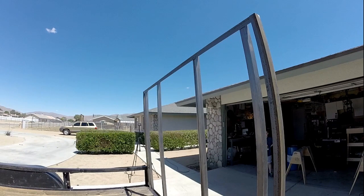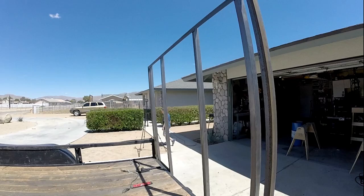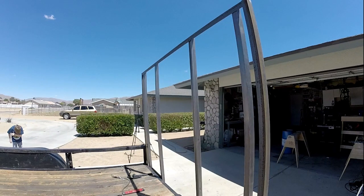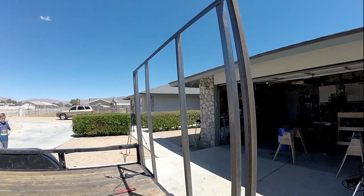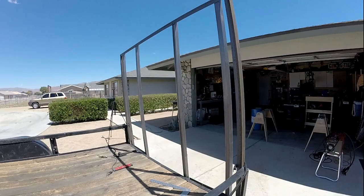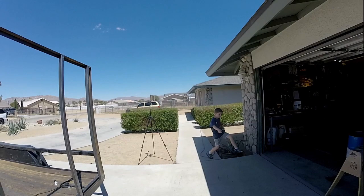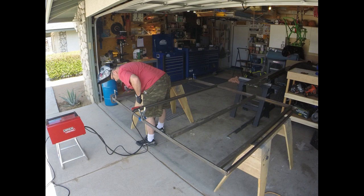In making this I realized that those sheets of metal are four by eight, so I have to create some kind of seam somewhere because a four by eight sheet isn't going to cover the whole thing — the length is there but the width isn't. This is wider than four feet in all directions, so I'm going to have to figure out a way where at that four foot mark, a little shy to give some overlap, I have to have one that goes straight across consistently so it will hold down that seam. That's where we're at. I'm going to start welding her up now — these are just sitting in here.